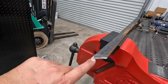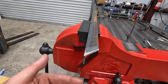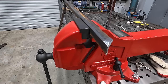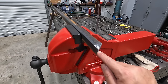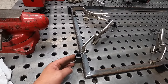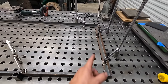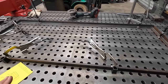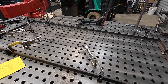The bevel goes on the bottom side so we'll have a full penetration weld there. The 45-degree cut sides get ground flat so you have a 90-degree corner to fill up. Once tacked in two places all the way around it'll hold the whole frame together, then I can stand it up and flat-weld all the corners. I've got this squared up to the pegs on the table — absolutely 90 degrees, within a sixteenth being square. My plan is to get it tacked, then make sure the box sits down in the frame before fully welding.